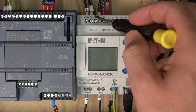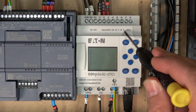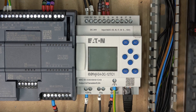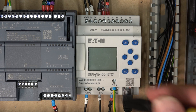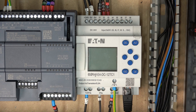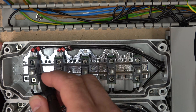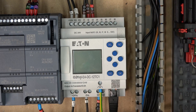The zero terminal is also used for the analogue inputs. Inputs I5, I6, I7, and I8 can work as analogue from 0 to 10 volts - we'll check that out in an upcoming video. For the outputs, I'm using a separate power supply: 24 volts goes in, zero goes in, and as the program executes its sequence it will output 24V DC to the lamps and to the conveyor belt, with the positives sent from the controller outputs.